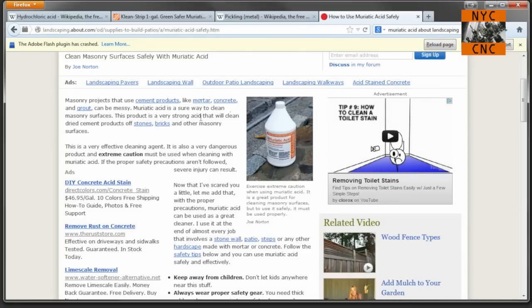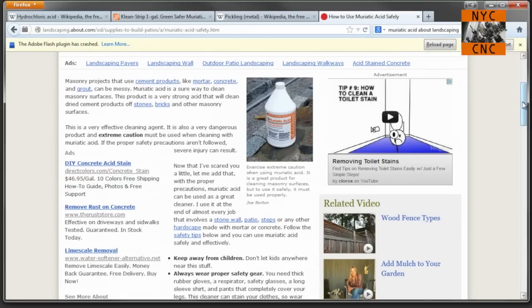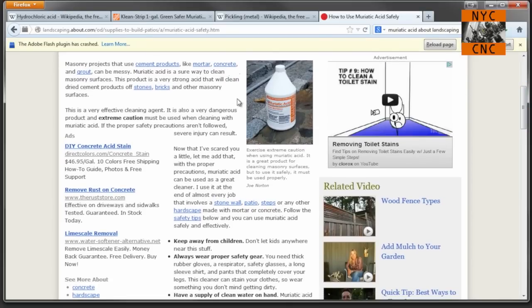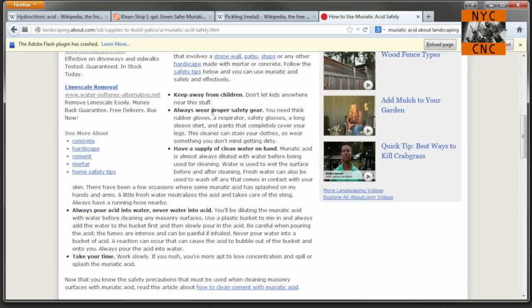A little bit about safety — look, it's acid. I'm not a chemist or acid expert. The thing you always remember from high school is never pour water onto acid, because the small amounts of water that first hit it can instantly boil and splatter and cause big problems. They use this stuff for cleaning concrete and grout. Usual safety stuff — safety gear. This stuff really does smell even my low-fume version, so I wear a respirator. I do it outside and make sure I'm upwind of it — you can apparently burn your lungs. This is big boy rules, folks. Be really safe about this.